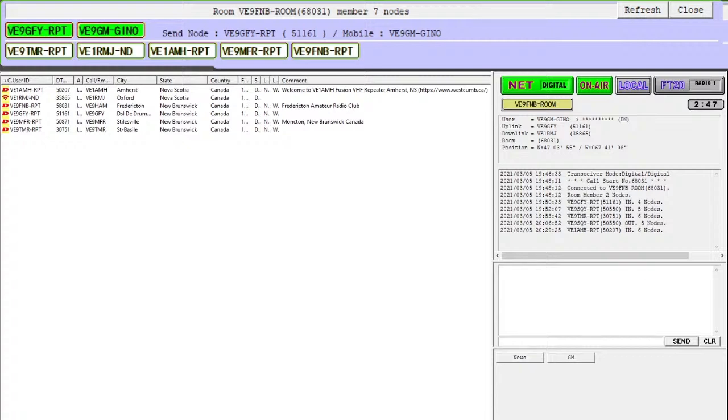I don't have much to report. As for antennas, I don't do much HF. I have an antenna on the roof of the house, a vertical. I don't remember if it's a dual band or just a 2 meter, but I use that for my APRS node. I also have a vertical quarter wave antenna that I built myself with the ground plane using just steel rods, and I have that in the attic. So I use that when I work in the garage. I plug my portable radio into that antenna and can hit multiple repeaters in the area. So that's pretty much all I have for comments.